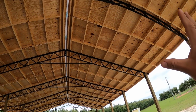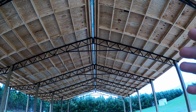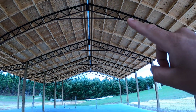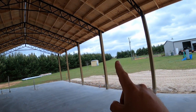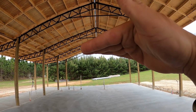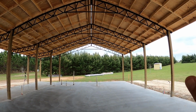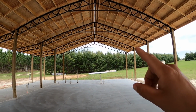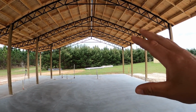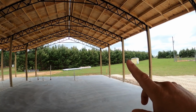And also in the living room, we are going to leave this ceiling vaulted, and we're going to leave this beam exposed. We like the look of it, but we plan on doing tongue and groove pine all along the ceiling. Then once you get to just on this side of this post right here, that's where the pantry wall is going to be, and we're going to bring the ceiling down to 8 feet. We're doing that for cost reasons, so we can have 8-foot sheets of sheetrock or whatever else we decide to do in here. Then there'll be a big attic space up there. I've got future plans for some storage on that, but there won't be room up there for anything else, but we'll have a lot of storage room. And we'll do an entrance up through the closet into that.